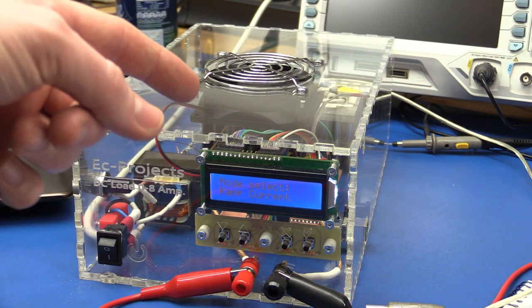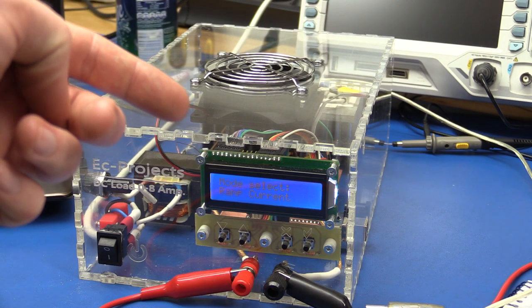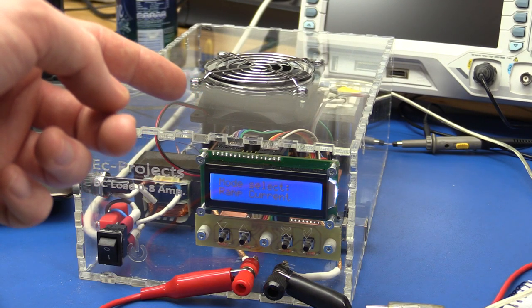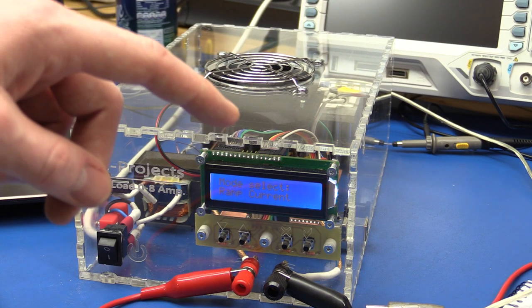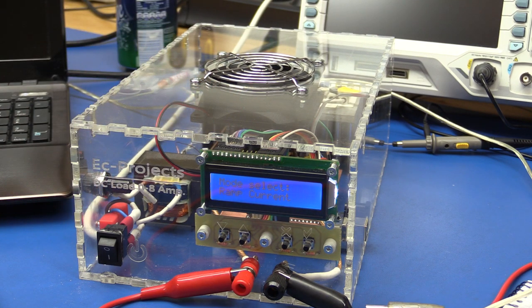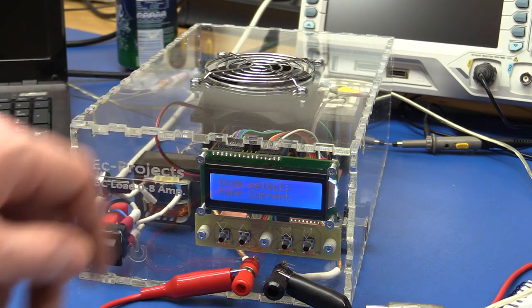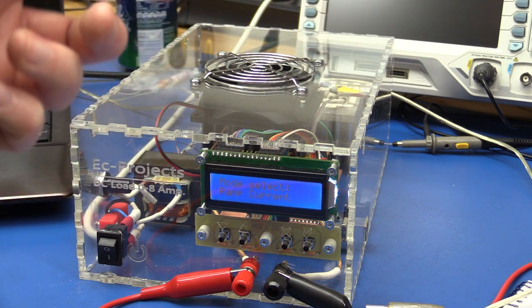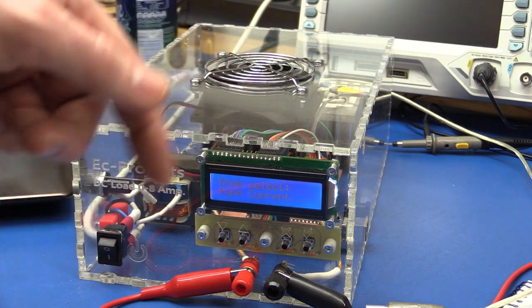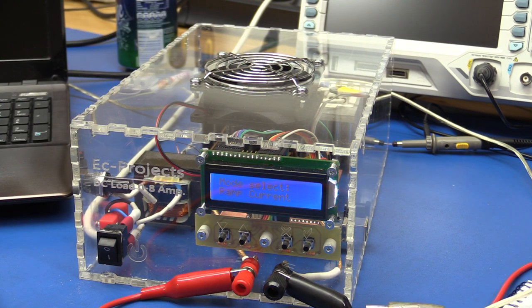The way I fixed that is to make a startup pulse. So for 1/4 of a second, the fan will get full power and then it will drop down to whatever the signal level is. I might be able to make the startup pulse shorter than 1/4 of a second, but I just picked a random value. And it's working. So now the fan can start up and it can slow down in RPM to just spin at a speed you can't really hear.